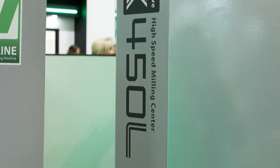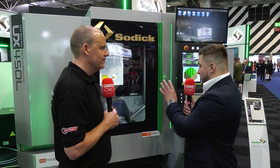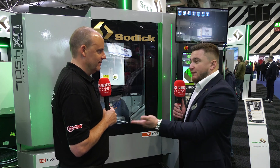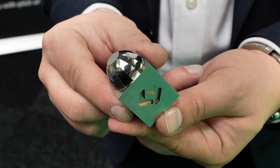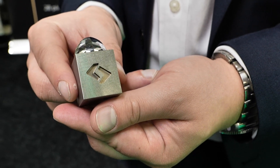The two work very well together. For electrode manufacturing, for example, this is a perfect machine for graphite or copper. But really, if you go for a hard milling process — some applications where sparking isn't necessarily necessary — we could do hard milling. Something like a Stavax component, we could easily hold very high surface finish and tight tolerance.